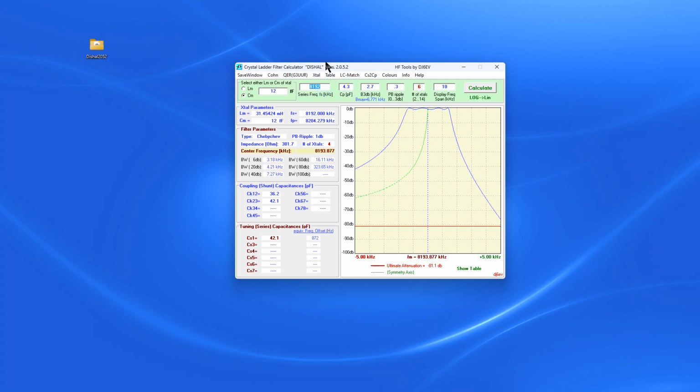Let's put our frequency in, 11055.079. And our CM was 17.581. And this will just give you a visual representation of what the filter should act like. Now, our Cohn filter won't be exactly this, but it'll be pretty close actually. So you can see what kind of skirts you have. You have a little bit of a looser skirt on the low frequency side than you do on the high frequency side, not uncommon.